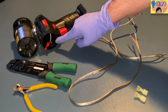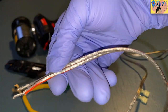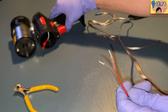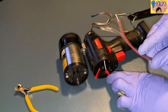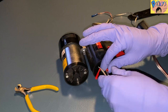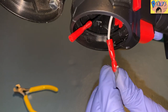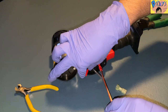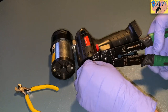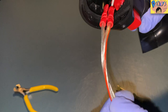Now we're going to connect our drill wires to some longer wires. I have some old 16 gauge electrical wire. You can use something similar that you have laying around, or go to your local hardware store. I'm going to use this red line as my positive. The white wire in the drill is positive and the black is obviously negative. So I connected my positive wire to the positive wire in the drill, and then connected the negative wire to the negative wire. After you're done crimping, always make sure to tug on your wires and confirm they're secure.